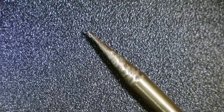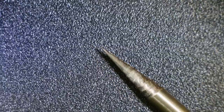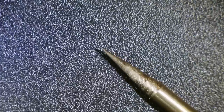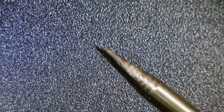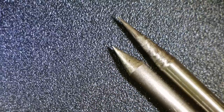And let's compare that to the 15 degree. And that is a long pointy tungsten. But again, you can see that out near the tip, the scratches kind of go along the tungsten rather than around it. They kind of swirl down near the base, because it's a round wheel moving in a circle, but near the tip, they're kind of longitudinal, kind of right where you'd want.